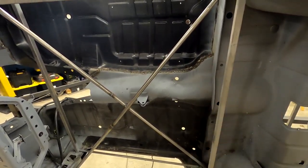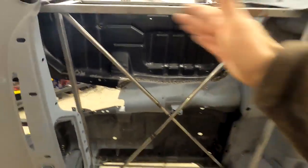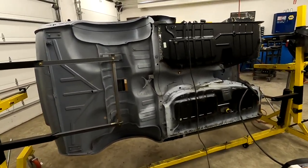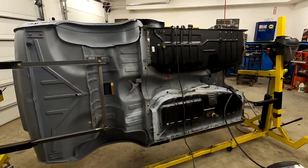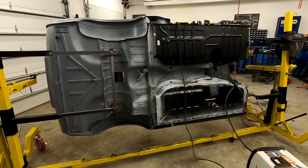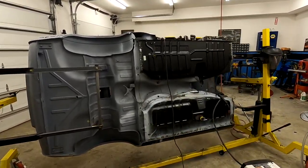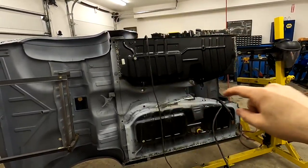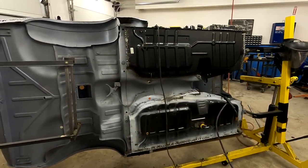But overall, I am really happy with how this came out. As I think about the last one that I did, I think it took me twice as long, and I had to fabricate some parts because I had cut first after measuring, and it still wasn't perfect. This just sort of eliminates the guesswork, and all you're really fighting with is your skill with the grinding cutoff wheel, how thick that grinding wheel is. I would also recommend getting the thinnest of those you can find. Ones I have are a little fat. Just the overall stuff, like working around the cage and the curves, and can you get your cutoff wheel in here?